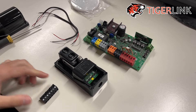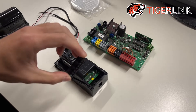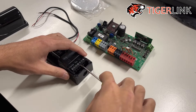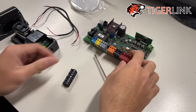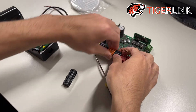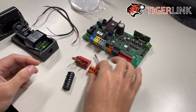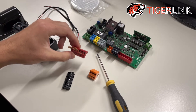Let's start with wiring. You can also look at the wiring diagram on our website. The terminal is removable — remove it when you do the wiring to make your life easier. Same goes with the terminal on the BFT control board — they are removable. For this photo cell you will need the orange block for power and the red block for the sensor.